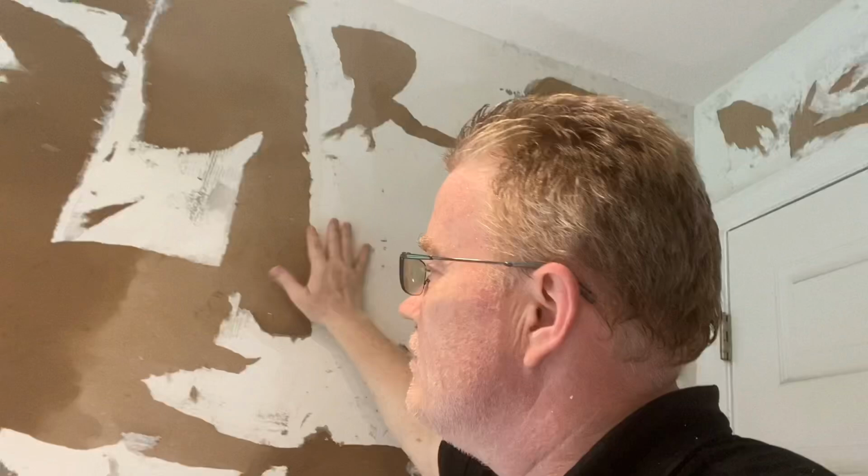Now, you've got it pole sanded, you've covered your floors because you're a good worker. You're wearing a respirator because you don't want the little dust in your lungs. Take a break. Come back, and now you're ready to seal.